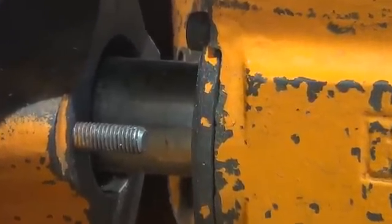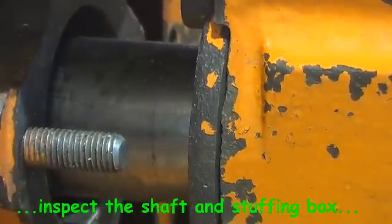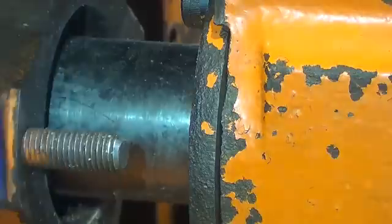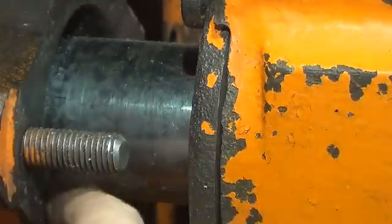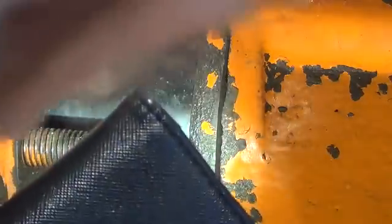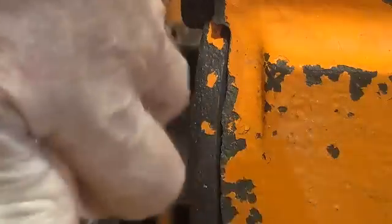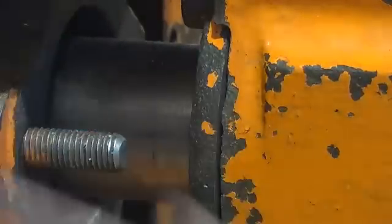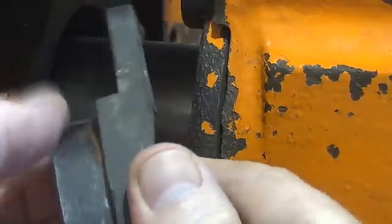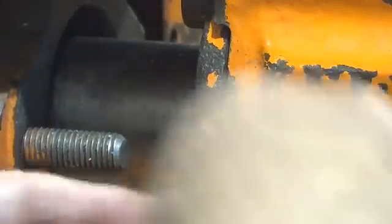It's also important once you have cleaned out the stuffing box to just check the shaft and check the stuffing box for any damage or wear. It's a little difficult with the shaft in a situation like that — if the pump was stripped down of course that would make it much easier to check. But any deep scoring or grooves in the shaft would still be pretty visible from here, and everything looks all right in this instance so we can go ahead with packing the gland.